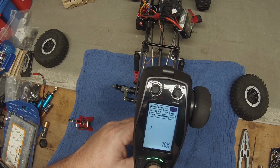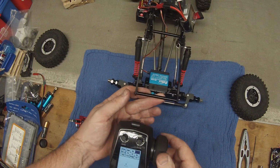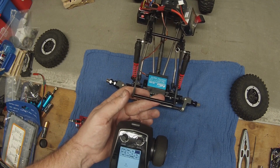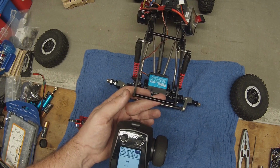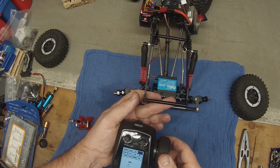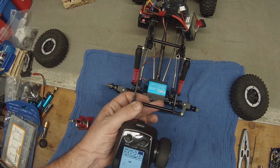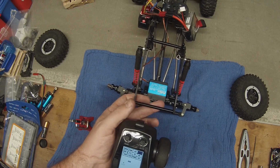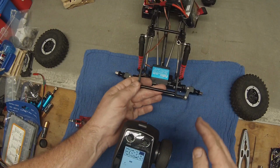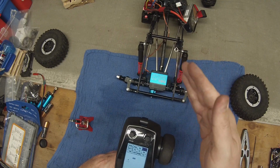and then you go to channel 3, and I have it at 70% right now. So I got it 70% that way, 70% that way. So you can dial this up or down. Say I only want 50%. So I got 50% that way, 70 that way. So dial that way down to 50. And now you only have 50% travel. So once you get your tires on and everything, you go in there and you can adjust this up and down to how far and how much travel you want.